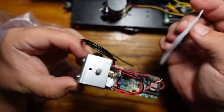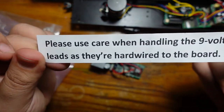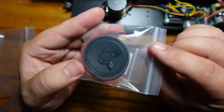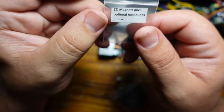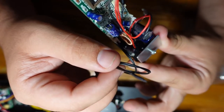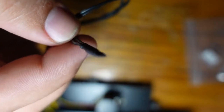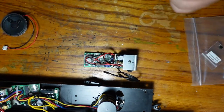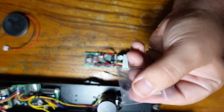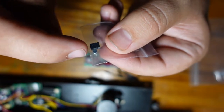Very, very simple board. It's got this warning about the battery — use care because they're just soldered to the board, so you don't want to pull those out or you'd have to re-solder. Here's our speaker — very important. These are magnets plus optional for the rail sounds jumper. This is your chug switch, as I call it — a little magnetic switch. When the magnet passes by the switch, you'll hear either a chuff or an idle sound or the engine revving up. That's why you get these two magnets. I'm not going to use the jumper; we don't need that.